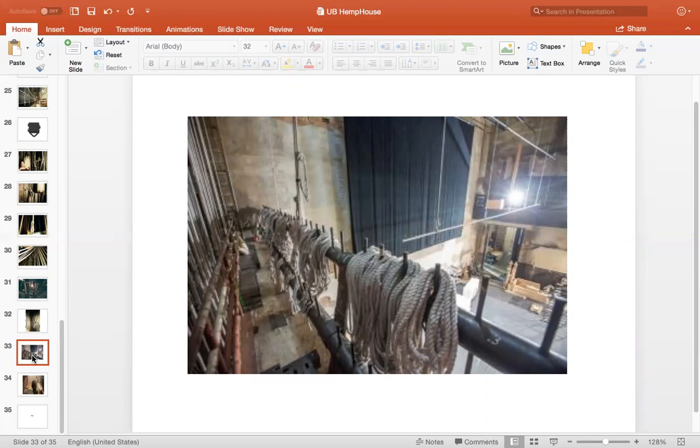Yeah. Having a pin rail, at least a single pin, single rail, is always a good idea, because you're going to need picks for stuff, even if it's just doing power feed picks for your lighting pipes. Right. But the double, which is a great piece of equipment when that's the primary rigging system, in this case, a double is redundant, if nothing else.